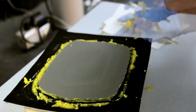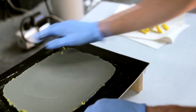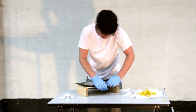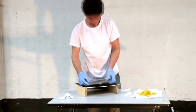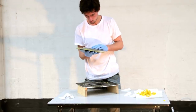It's because I had another project I had to do as well. So then I just let it cure. Normally it's stated at 12 hours, but it's always better to just do like 24 hours or so. So I let everything cure, I post-cured the part, so I put it into an oven at 90 degrees, because I will be using this part later on for high temperature moldings and so on, but it's not really needed if you're just looking to do what I did in this tutorial.